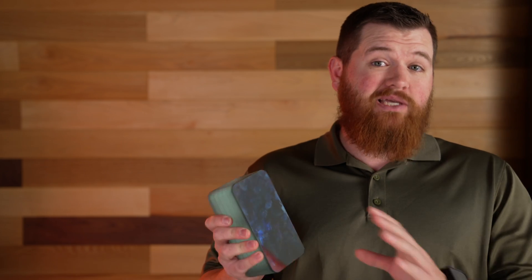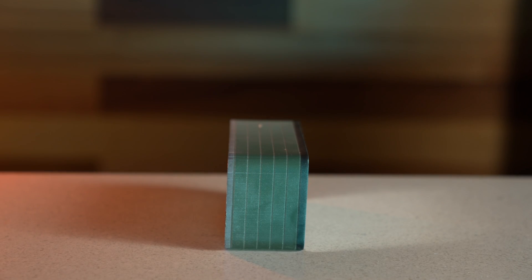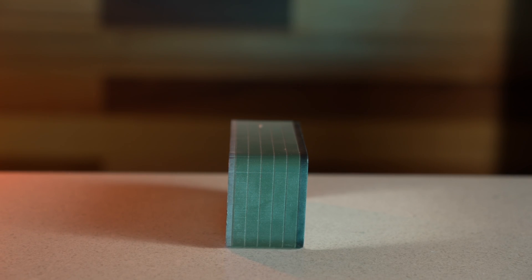We want this stuff to last as long as we can and to stay as transparent and looking as good as possible. So long story short, when you are cleaning your ballistic glass — if your outside layer is pure glass, you can clean that normally. If you have exterior windows facing the outside of your BRE, guard booth, or building, you're pretty good to clean that with standard materials on the outside. But on the inside, or anywhere there's polycarbonate exposed, strictly mild detergent — warm soap and water, microfiber towel, scrub it down with a wet one, clean it off with a dry one. That's about all you want to do with your ballistic glass on the protected side. As long as you do that, it'll keep it looking good over the long haul and prevent it from fogging up and delaminating.